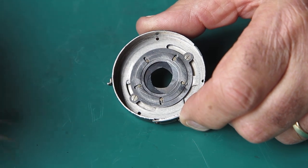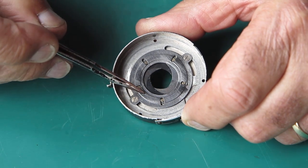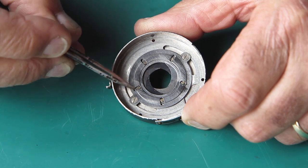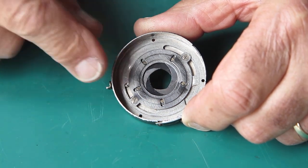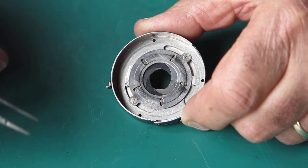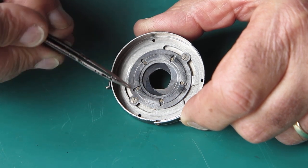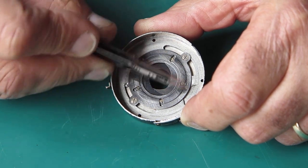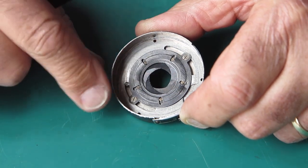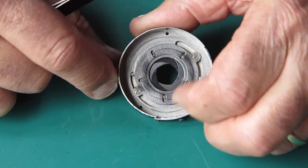The secret of success was - I tried various things. I tried building it onto the moving plate, but the problem there is that the rivets are in the slots, so the blades tended to float about, and when I went to try and get the case on, it didn't go well. Assembling it into the case worked better - I placed each blade individually, and swung them back out of the way as far as I could to slide the other blades in where I needed them to tuck in underneath. And that worked quite well.